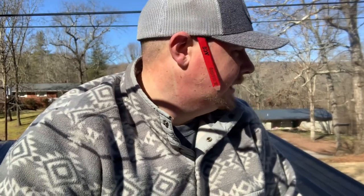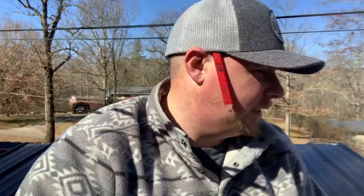It doesn't look very high up when you look at a camera, but it kind of feels pretty high. The entire roof is on except for the ridge cap. I've got Wyatt cutting it and he's going to send it up here. I'll cut it to length, attach it, and the roof is done. The other pieces, the gable end trims, go on after the siding gets on. Make sure that water goes the direction you want — you don't want it going behind your siding.